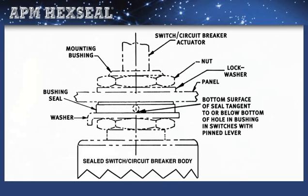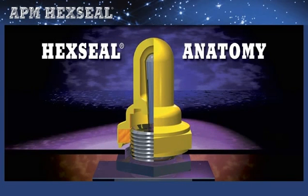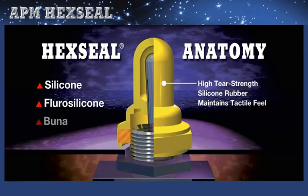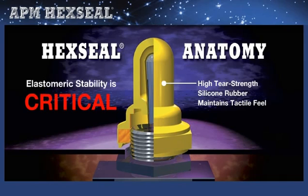It's also UL recognized and meets MIL-B5423 specifications. To achieve an effective external hermetic sealing boot based on operational temperature and chemical exposure, we select an elastomer — typically silicone, fluorosilicone, BUNA, etc. — to a precise durometer and tolerance so as to maintain a desired tactile feel and prevent elastomeric memory interference. Elastomeric stability is critical. For example, to prevent silicone outgassing, APM uses proprietary procedures for the removal of volatiles from its cross-linked composition.